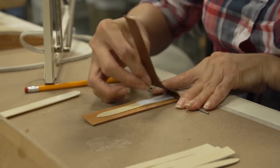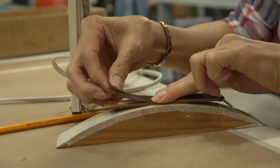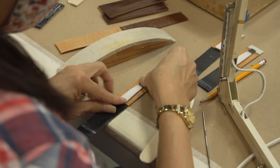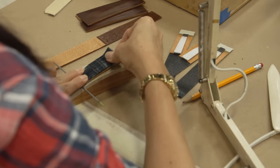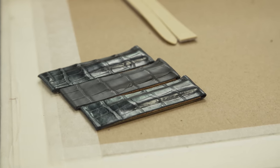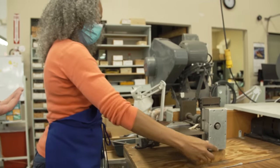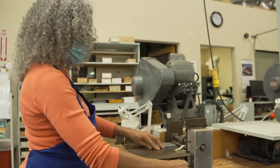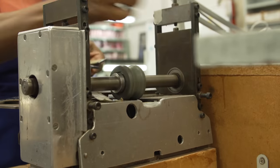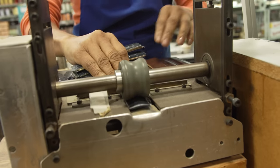Now she's taking a bar to replicate the spring bar. These steps have been in place since I started. Is there any difference in the process with different leather materials when applying padding? No, it's still the same. After we pad it, it comes to this machine. We have different lengths and sizes but can adjust it, and we roll it to help hold the padding in place until we chop it. Same for the buckle — it goes through here also.